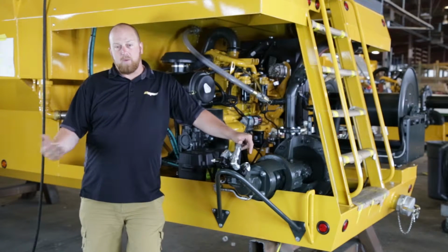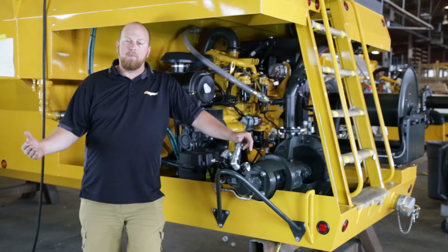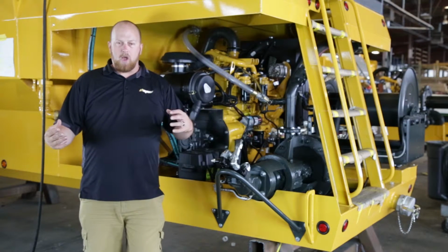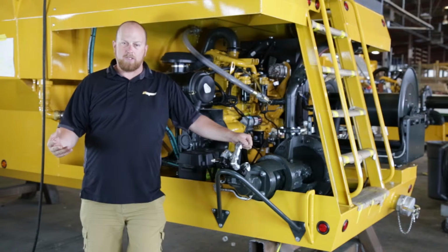The gear pumps that we use on our smaller machines don't cavitate because they can pump air. So not only can they pump a thicker slurry, they can pump air. In addition, everything that goes into those pumps gets pumped out the other side. They don't bypass internally and lose performance with thicker slurries.